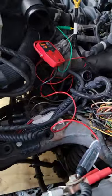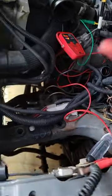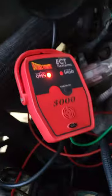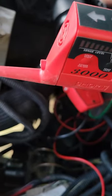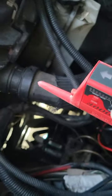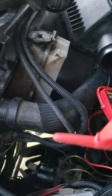I just want to give you guys a rundown on how to run this thing. Don't forget to lock in the signal — same when you're doing a short circuit. Mine's an open; if it was a short, it would switch to short. The difference is: on this device, the short is detected here, and the open is detected through the antenna. So you get the use of the arrows — this thing will actually point you in the direction you need to go. If you pass your break or your open, it'll tell you to back up. Boom — and then it'll light up again.